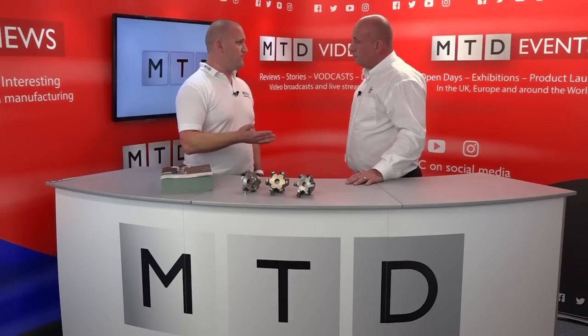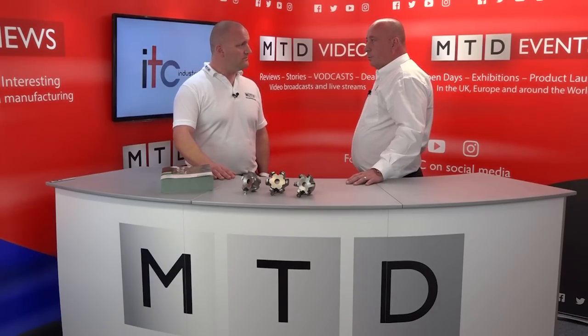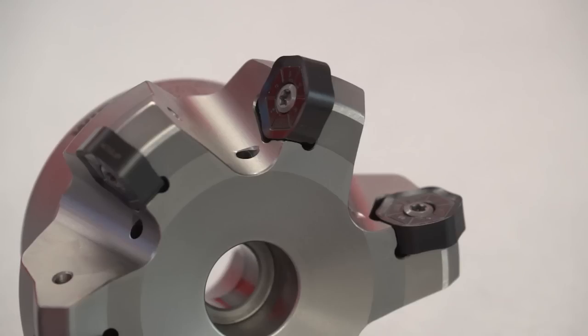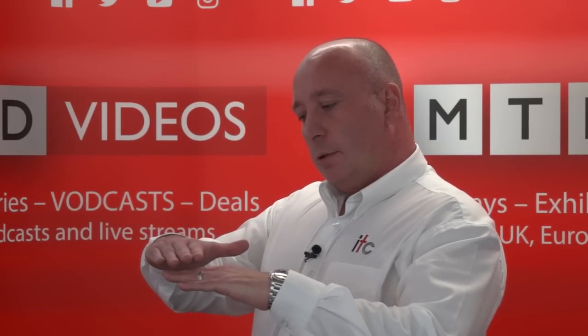These are face mills — what if we need to improve the finish? Can we get a wiper insert in these bodies? Yes, the wiper insert is available, but only in the 45 degree approach. On an 80 diameter cutter we suggest around about one wiper insert. On larger diameters we can put in more than one. The wiper insert actually sits a little lower than the other inserts and has a flat face on it, so it creates a smooth finish with only one or two inserts actually creating the finish you see on the part — taking a very limited amount of material off.